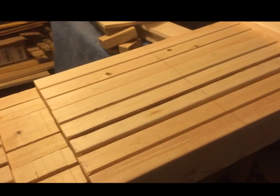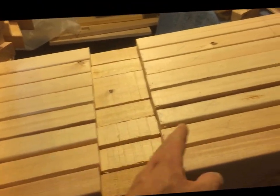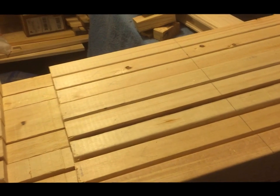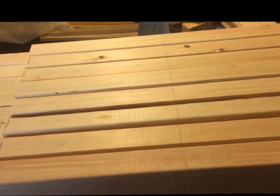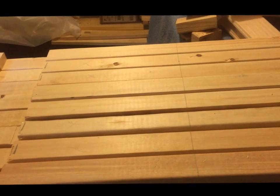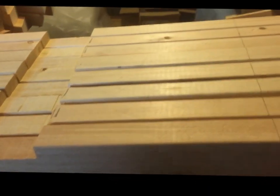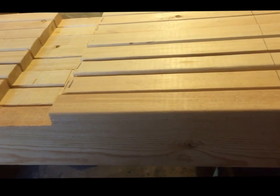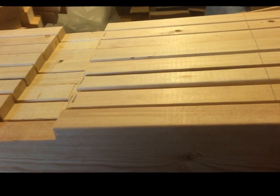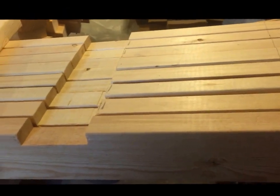Instead of doing one center keel I'm doing two keels on this one, for a particular reason — I wanted a little bit of extra support in the middle and outer edges, as opposed to just the center. Since I'm filling the whole bottom with foam and doing a double layer, we'll have the three-quarter inch plywood skin on here for the actual hull, and on the other side, which would be the top, we'll have the floor of the boat. Sandwiched in between will be the styrofoam, which will basically make it almost act like a double hull boat by the time I'm done, because not only am I putting a floor in but I'm also going to run it up the side pieces.